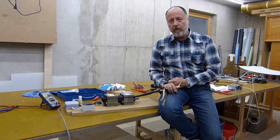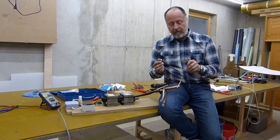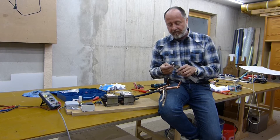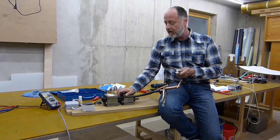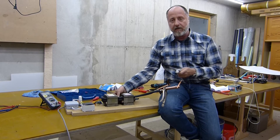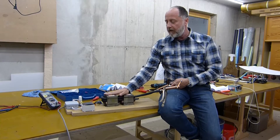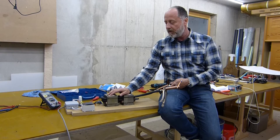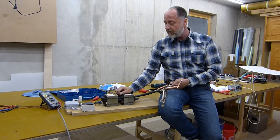Now you have seen that it works, at least. We have done some pretty nice welds — I did five. The problem I then had was that the primary coil overheated and started to create some smoke, so I stopped welding. I do not have a current limiter in there, and I'm afraid that I'll overheat the transformers — the primary coils will burn out and that would be the end of the story.